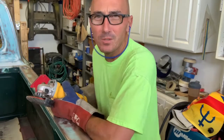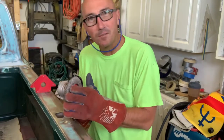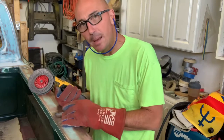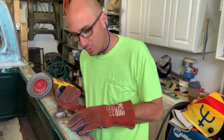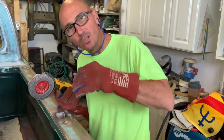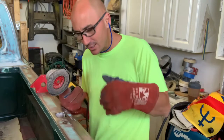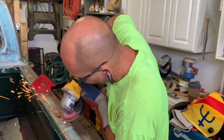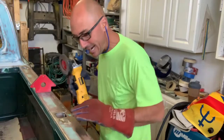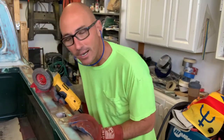So I found that when I'm starting with the sanding, I start with this sort of flat first, just to really get the high part down. As I notice that I'm getting closer to the actual metal, that's when I start tipping it up and getting it more on the edge, just so that I stay only on the weld. Ooh, that one's nice. You can't even tell there was a hole there. Almost makes me feel like I know what I'm doing.